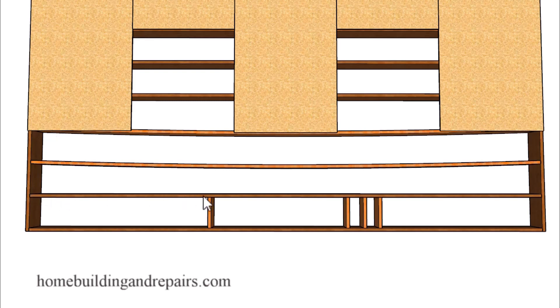If you can start with a straight floor joist, great. If not, you're going to need to use a string or laser tool to straighten the joist. It wouldn't be a bad idea to put some blocks in to provide a little more support. Keep in mind this floor joist is still going to be nailed to the floor sheathing. Once you pull all of the nails or cut them, you can use a Sawzall to cut the nails between the joist and the sheathing, or use a nail puller from above. This could damage the floor sheathing, especially at the edges where you'll have more nails in a weaker spot.